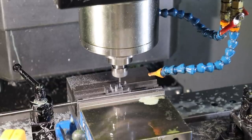Okay, so the program finished doing the rough cutting out of the shape and then the radial 3D profiling of all of those pins that you see on the surface. When we did machine those radial pins, I actually added stock to leave on the part such that we could go back and do a final finish cut. Sometimes when the radial machining happens on delicate pins like that, the pin will actually flex a little bit and cause a gouge mark into the pin. So we're doing a two-stage rough finish and then a final finish.